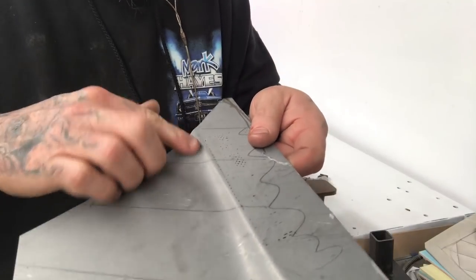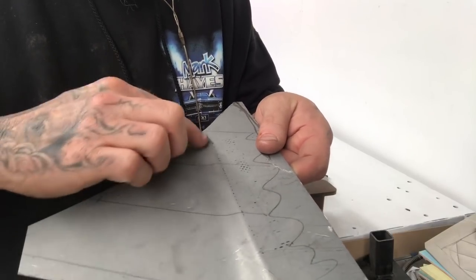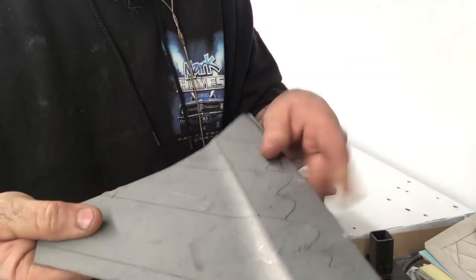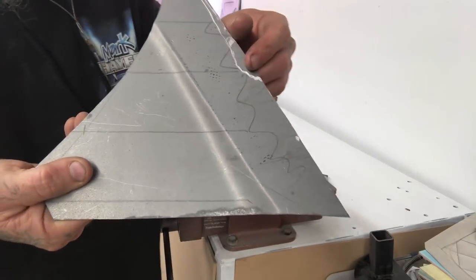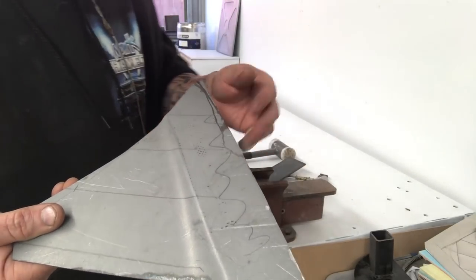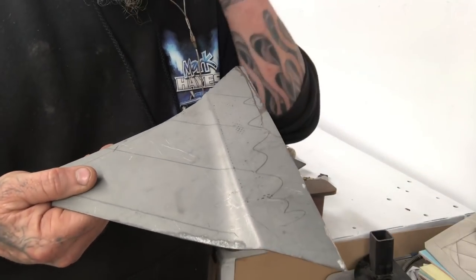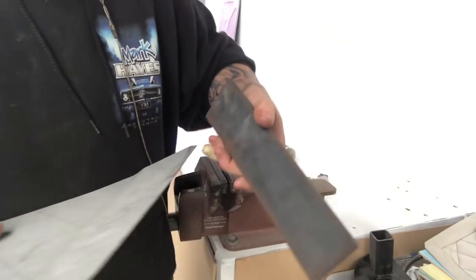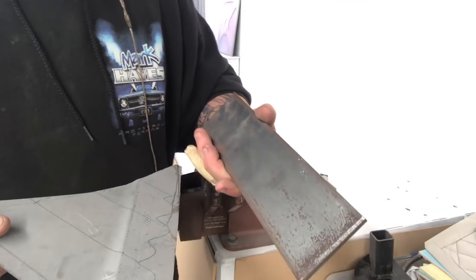It's a nice simple trick, but I've used this a lot to make XY Falcon quarter panels and all sorts of things. I'll use this where I'll do a 45 degree fold and then just bend it back by hand to give it that nice smooth radius. Hopefully that's something you can use. I just did this in the vice because it's only a small piece. Something I probably didn't mention before was using pieces of metal to sandwich the job if your vice isn't wide enough.